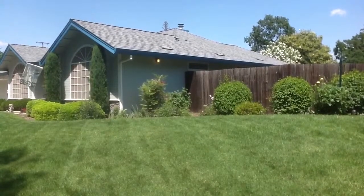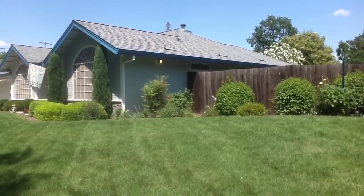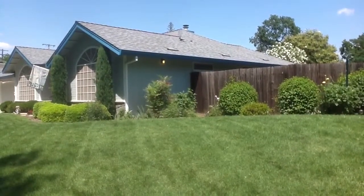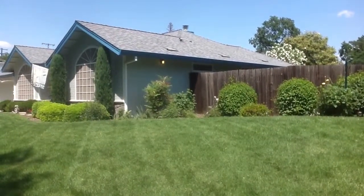Ventilation is quite important to have a balanced ventilation system in your house, both intake and exhaust. And as you look across the ridge, that shadow line that you see on the top is actually a ridge vent. So this particular house now has some balanced ventilation.